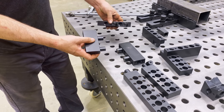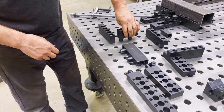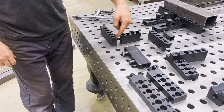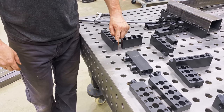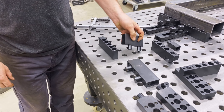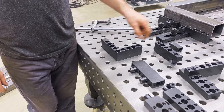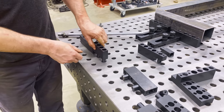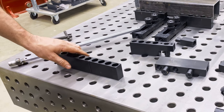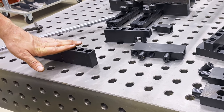But you're probably wondering why they're offset. The offset allows you to put the fixtures together and make 90-degree corners. There may be a gap because you need to get a tack weld in there, but if you want a zero clearance fit you could just turn it 90 degrees. And you can start stacking them or making long fence blocks — make a whole row of them, just continue to add as many fence blocks as you have available.